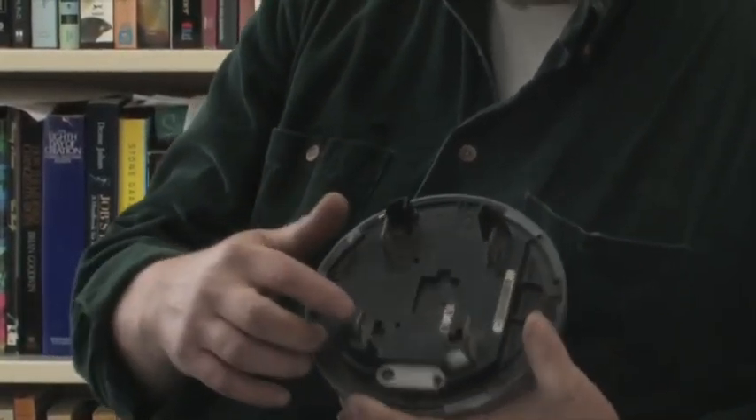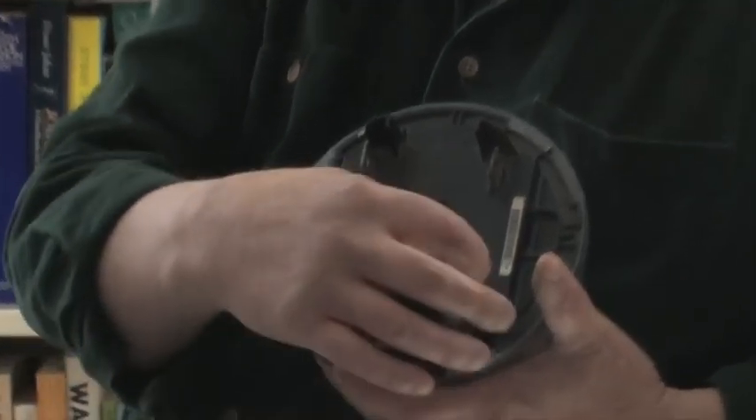My name is Robert Marks and my electrical career started in 1981 as an apprentice. I've been an electrician for the rest of my career up until 2008 because of health issues — I'm now disabled. In my opinion, the problem with this particular meter involves what are called in the trade 'stabs,' which are current-carrying bus bars that travel through the meter. They have ring devices inside that detect the current flowing across each phase.